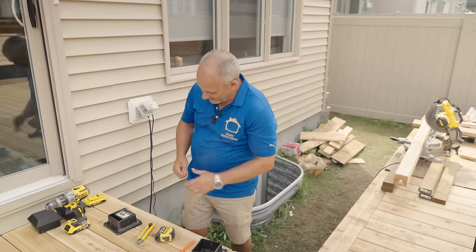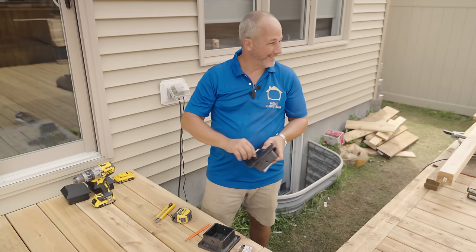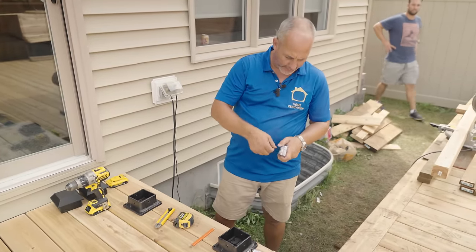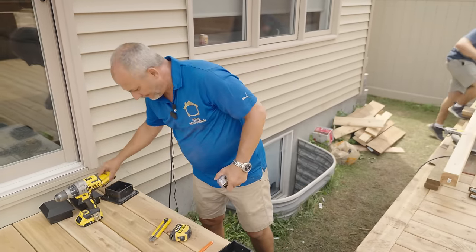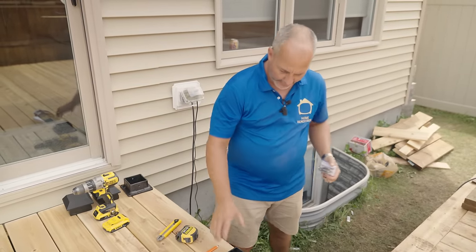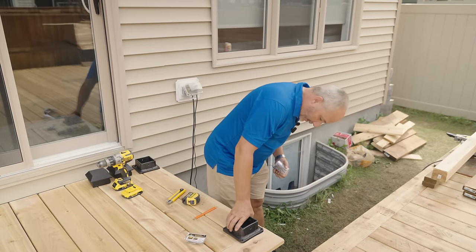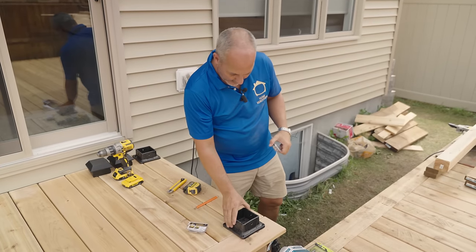All right, the last part of the project today is to finish installing a little handrail here. And as you know, we're going with black accent. So we've got some caps over there, gone with the post bases. There's another option. You could have always done the 4x4 post as a part of the structure. But generally speaking, a safety railing like this, just for a couple feet off the ground, it's not really necessary to integrate it. And it's a little more flexibility for location. This allows me to screw the bottom of the base right down, right to the bottom here. And I can pick my location to be right on the joist on three locations, at least anyway, which is good.